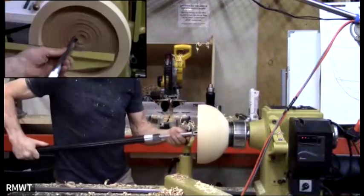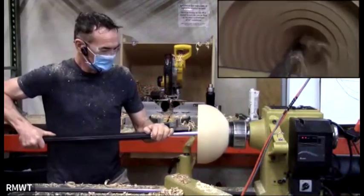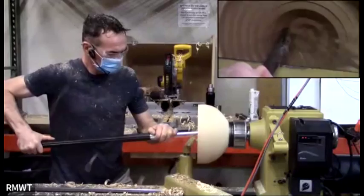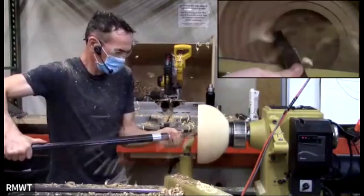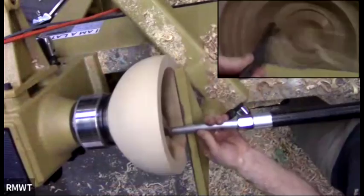Right, so a little bit deeper. So look at my grooves. All I did here was leave the grooves. So let's put my gouge back in them to make more space. With my gouge, I don't have that difficult start. And going in here, go a little deeper. And then start the swing again. Now this time the swing is a little bit earlier because I'm following my outside shape. And I'm using those ridges to help me out.